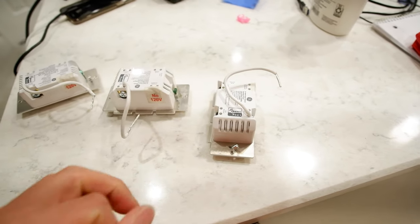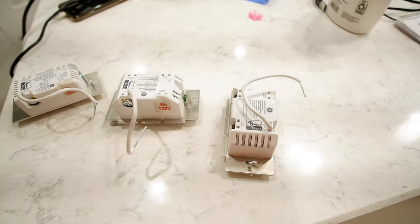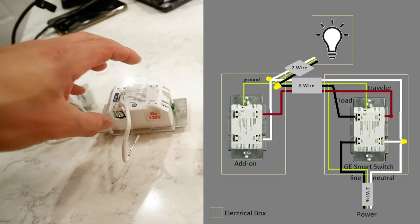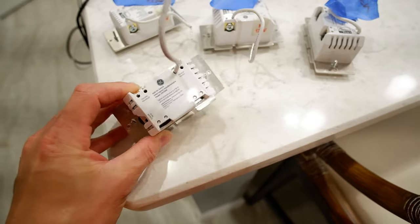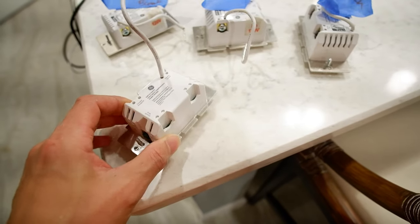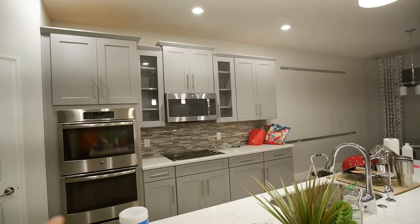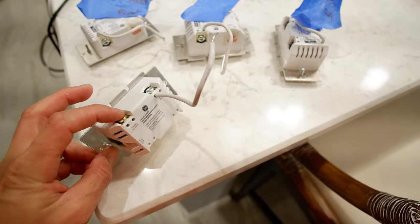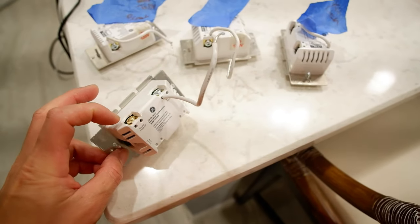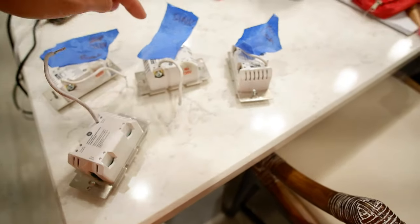Notice these have the no-120 on the side for the three-way traveler. With a smart switch you can't do a regular traditional three-way — you actually have to buy the mating add-on switch for the three-way application and wire it up the way the manufacturer specifies. Here's the add-on three-way switch I'm going to be adding today, because my kitchen lights are three-way. It's pretty basic — all it needs is a neutral and then you connect your traveler. The key is connecting the load through to the main switch so when you click the add-on it sends a signal to the main switch and turns it on.